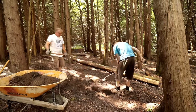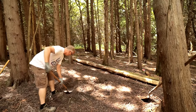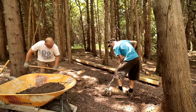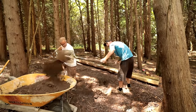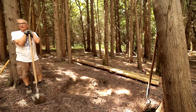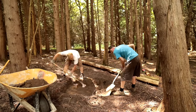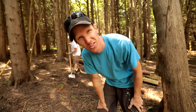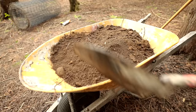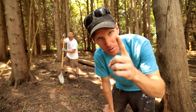Once I've done that, I take the inside of the gabion basket, which is going to be my structure on my walls, and I'm going to parge the inside of the fireplace with clay. Now, the clay is going to act kind of like my refractory cement. Geez, we're getting technical now. So the refractory cement's going to keep the firebox intact in order for us to direct our smoke up into the smokehouse to smoke our meat. Just to be clear, we're making a smokehouse, not a pizza oven. Smokehouse. Stick with the plan, Kevin.